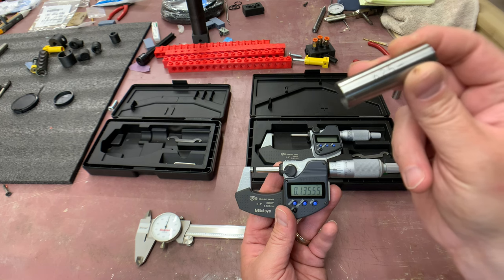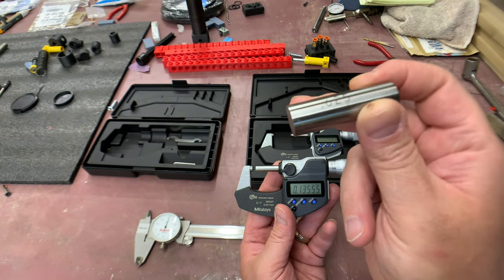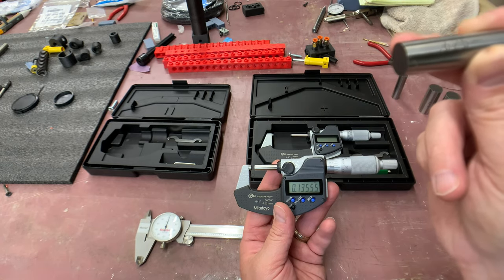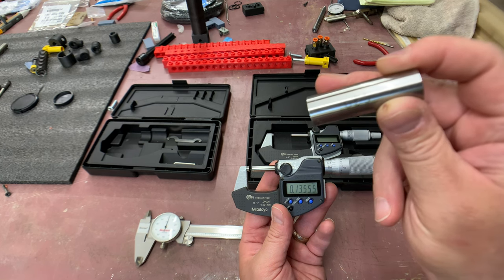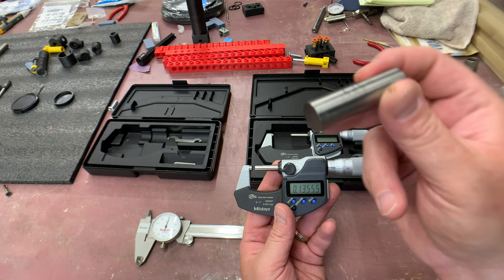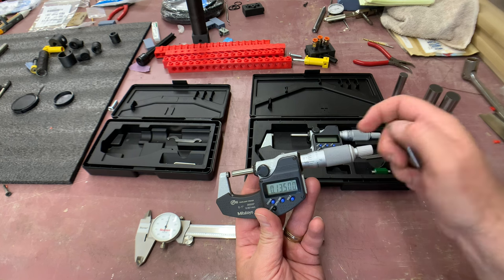This gauge is designed to be just a subtle slip fit so it can fit inside the hole. If both the hole and pin gauge were exactly 0.625 it would be a line-to-line fit - almost a press fit, very difficult to slip in and pull back out, essentially a static or friction fit. So these have to be undersized to indicate the correct size. That's the science of measurement - precision ground instruments are all about comparison.